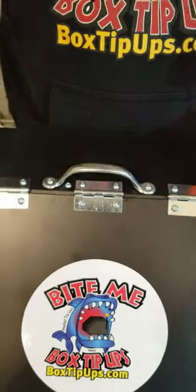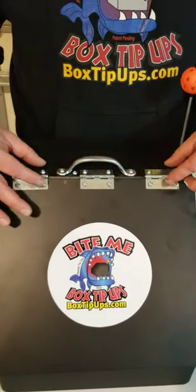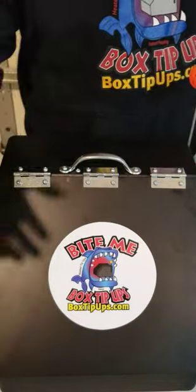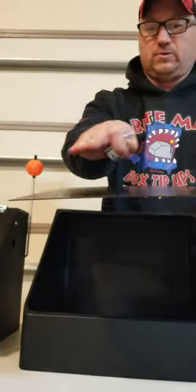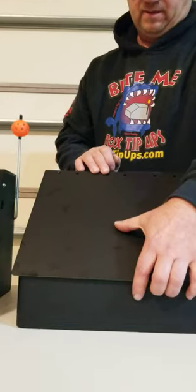So I like to just put 4 of them in or whatever, try to get it preset a little bit, double check it, put the next ones in, double check it. And you want to make sure that that lid's closing nice and tight. On the lids, you'll notice they have a little bit of a concave to them. It's very important that that concave goes up. So in this situation, that lid's got a bit of a crown to it. So you'd want to have that up like that.